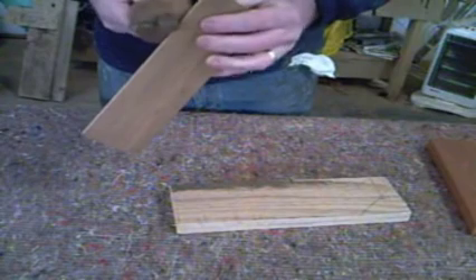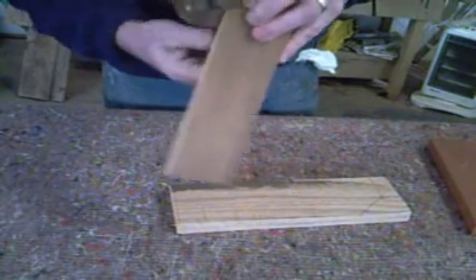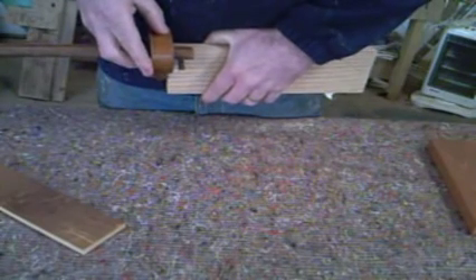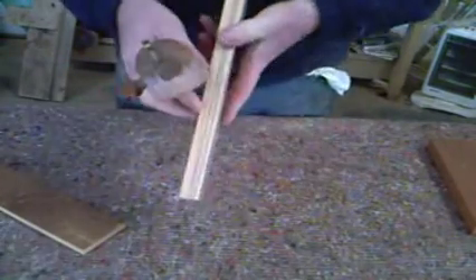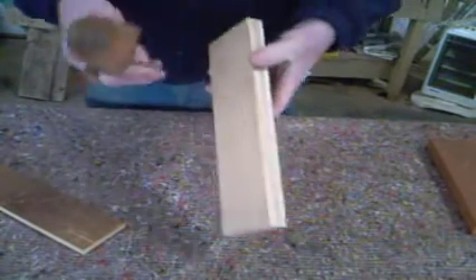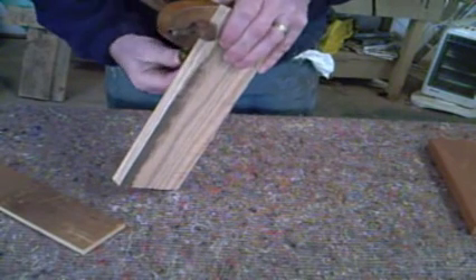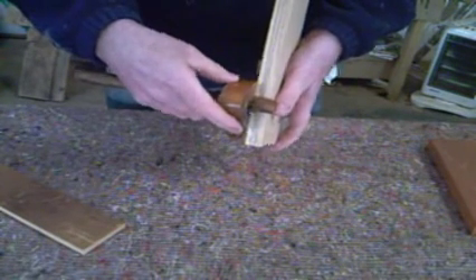Cutting gauge again for the cheap pine on the back. Set your edge — you've got the thickness of the back. Now go to the back of your drawer sides and mark the line on both sides. Now the thickness of the drawer sides. I've pinned these two drawer sides together and pre-grooved them — it makes it easier. Shoot your drawer sides all in one go, don't do them separately. It's a bit of time saving. Now set the cutting gauge up to the thickness of your drawer sides.